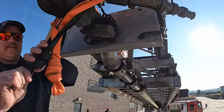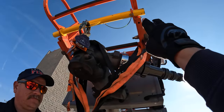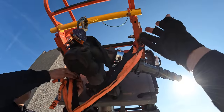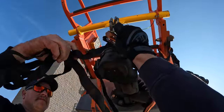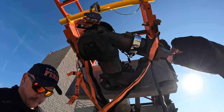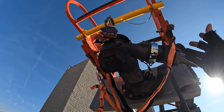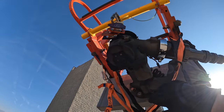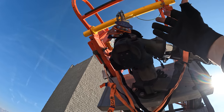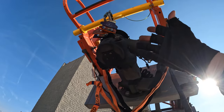Anchoring your high point to the tip of your aerial ladder — not all aerials are made the same. We have a pre-rigged bar that goes to welded points rated at max 250 pounds per eyelet, so the system where the pulleys are could be argued as a max 500-pound working load. On a four-to-one safety factor, that means this thing might break at 2,000 pounds — which is not a lot compared to OSHA anchorage standards requiring 5,000 pounds minimum or 22 kilonewtons.